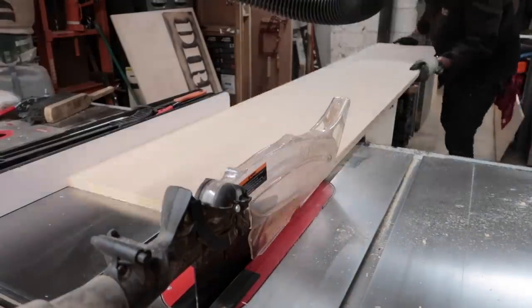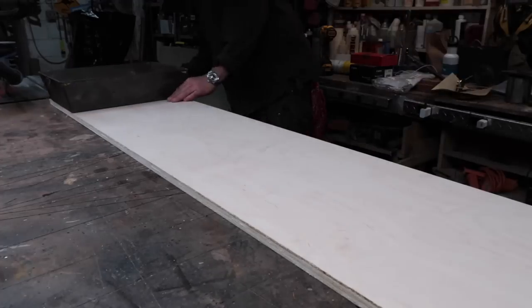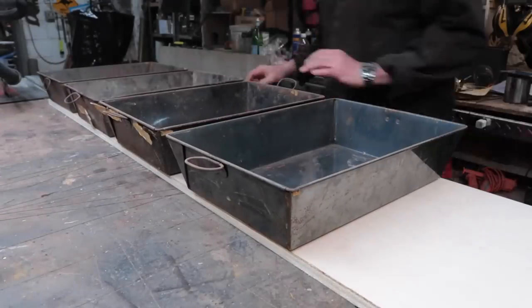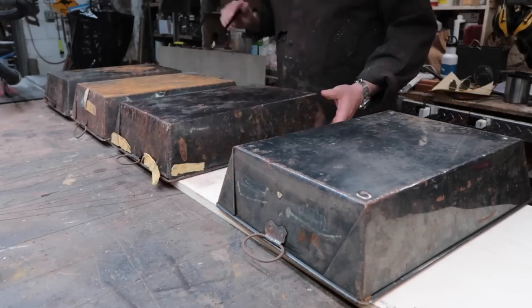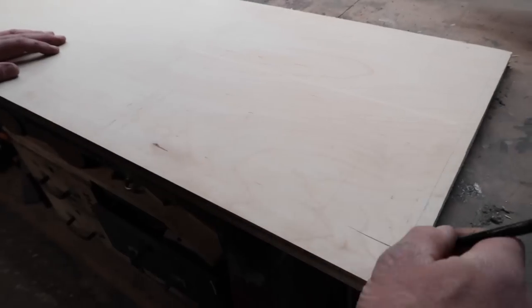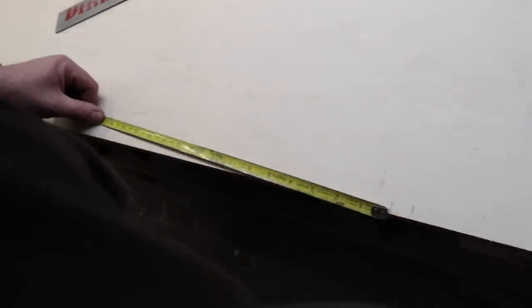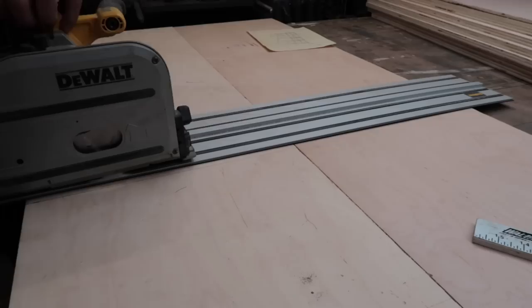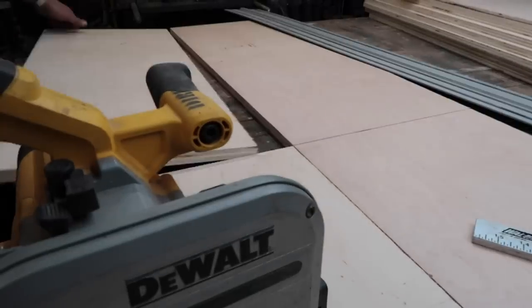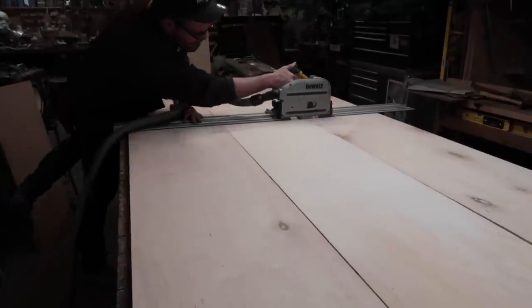To carry it, because I walked away from the lumberyard with it, I had them cut it into strips of 16 inches. I just wanted to recut it to make sure they did a good job, because they usually don't, so I passed it all through the same width of the fence. Whenever I measure anything, if I have the actual real thing like these bins, I always lay them in place to make sure my spatial layout is correct, and then I double-check it with the ruler.